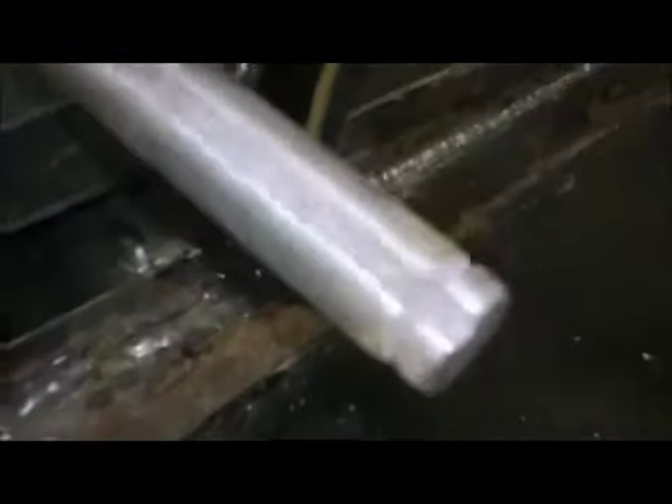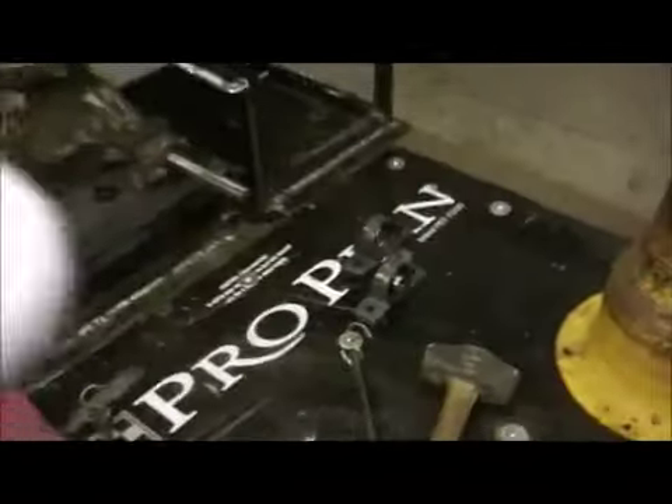She's keyed to the key on the shaft and she has two set screws on it — one's right on the keyway and the other one's on the other side. That just slides over the shaft with the key and the keyway groove right there.